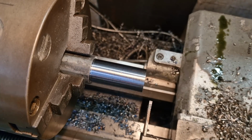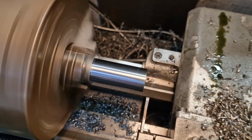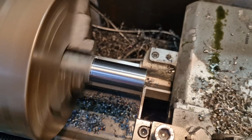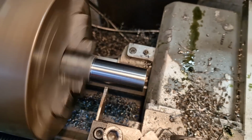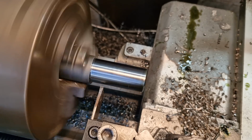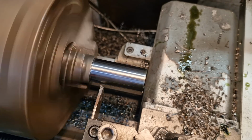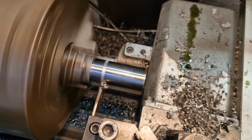We're in with a cut off, with a parting blade, so slow things down a bit. And touch off on there, look, like that. And then go 43mm along, which is there. I'm just going to lock my cross slide, well, my saddle. Bear with. And now we can get that cut in. So I'll get that started.